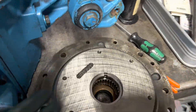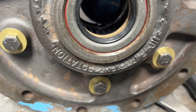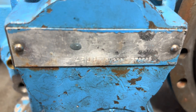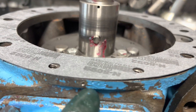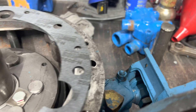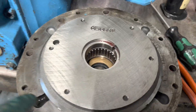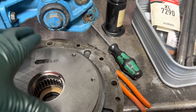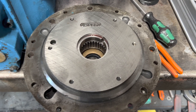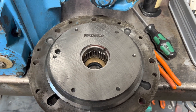Getting ready to put the pump on our Paragon - this is an invertible pump, similar to a Velvet Drive. It tells you up for left rotation or up for right-hand rotation. I know this is right-hand rotation because it's a PV-32R, which means right-hand rotation on the tag. But if you're not sure, I always mark them - I put some center punch marks here. Somebody else put three, I just did this one. So I know when I line those up, that's where I'm at. This gasket looks like it can go a bunch of different ways, but there's only two holes that matter - this is the intake, and this is the return line to the case. On the pump there are four choices, but these two line up or these two, and you spin the whole operation around. If you put this on the wrong rotation engine, you'll have three neutrals and no pump pressure. Only two of these are used at one time depending on the indexing of the pump - just a tip.